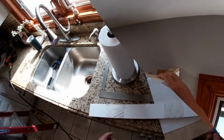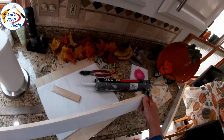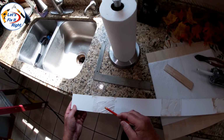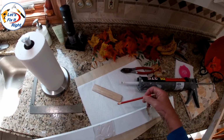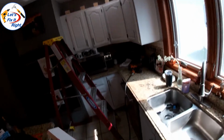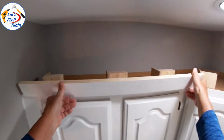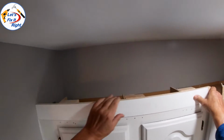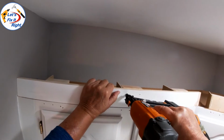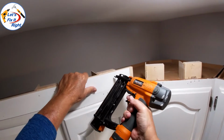So we got 11 15/16 of an inch here and 22 inches in that direction for this piece on this side. Okay, so I have the back side of this piece of the baseline frame glued at these 3 locations, here, here, and here. So at this time, I'm going to put this in place and nail it to the reinforcement blocks. Simply push this up against the 3 blocks, put it in place like, and I think I'll put 4 brads in each block.